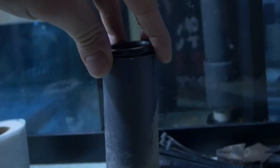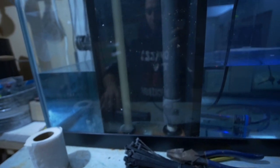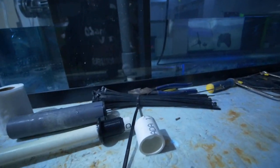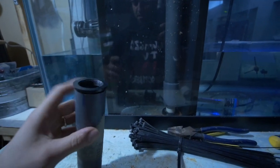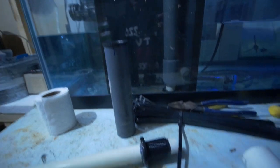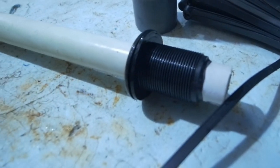It's slightly on an angle right now but I'm going to hold it nice and square - it does fit in there pretty reasonably. I just kind of made my own socket out of this PVC pipe to tighten up this bulkhead. I removed the nut on the bulkhead already, cut the PVC pipe, and now I'm ready to install the bulkhead back in. I'm going to put back in the pipe, get the bulkhead nut along with my new socket, tighten it up. Not too tight though - you don't want to crack it, it is plastic.